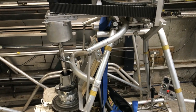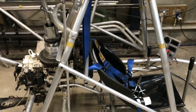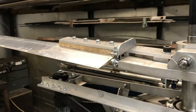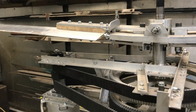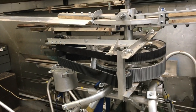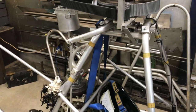As you can see, the lift is nearly there. That's with six degrees of pitch on the blades, so I'm about at max travel now on the pitch — I can't get much more, and the engine won't do any more either, I think it's at its maximum. I think it's lifting 90 to 95 percent of the weight including myself now, so that's where I am.